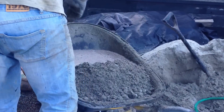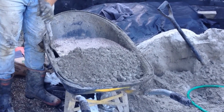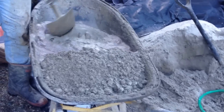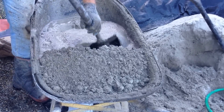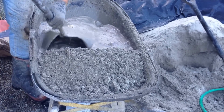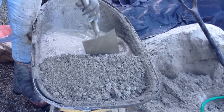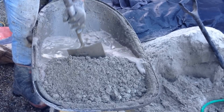I'm going to get my spade, or you can use a fork if you want — the fork is quite good for this. Just come through and mix that first lot so the cement goes right through with the water. There's quite a lot of water in there; you get to judge it after a while. You can see how it's going through the sand nice and easily. Make sure there are no lumps of cement — just really mix it in. You can see it's all sort of a sloppy mix now.